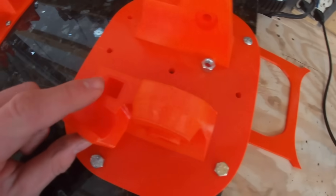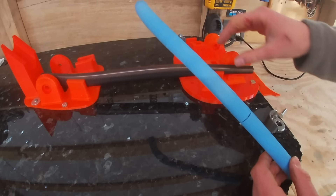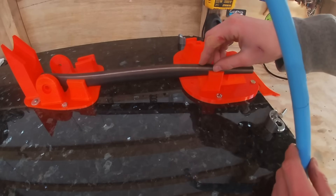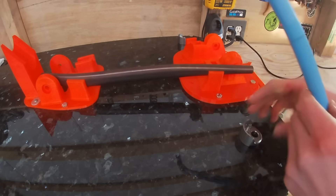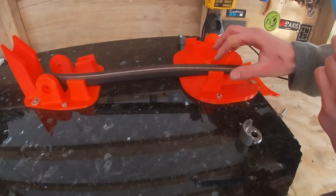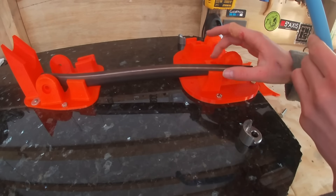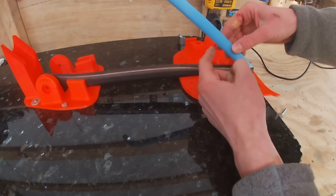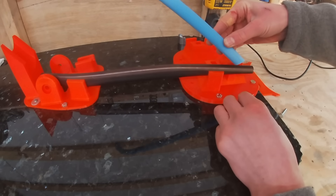I've made a square hole on each side. We've got the square pegs on either side. The chainstay is going to be lying here, and then we're going to have the dropout here. And then I plan on having a square peg fit in this hole on either side. It will reach over the chainstay and grab a hold of the seatstay with a little claw right here.